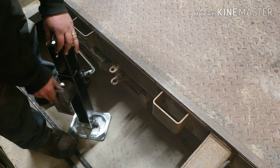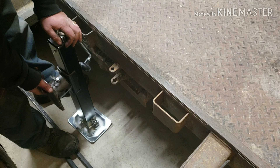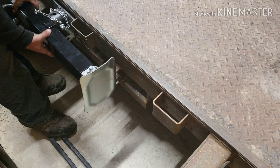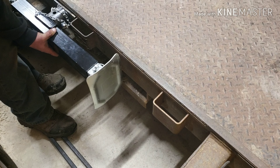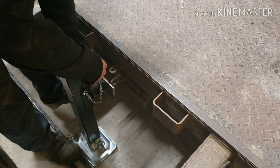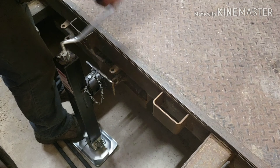For the back jacks, they came with a round tube to lock them in. I just welded a half-inch plate to help spread some of the weight out. I'm going to get them welded up so they don't affect the ramp, and then I made a mark over here. Now I'm just going to get these turned, raise the level of the jack, and get them welded on.